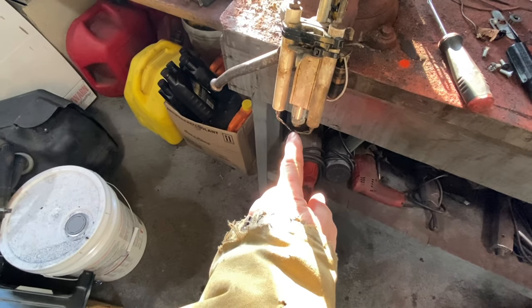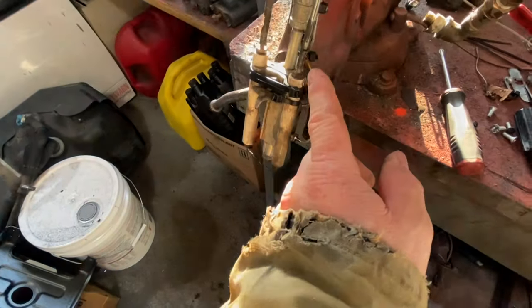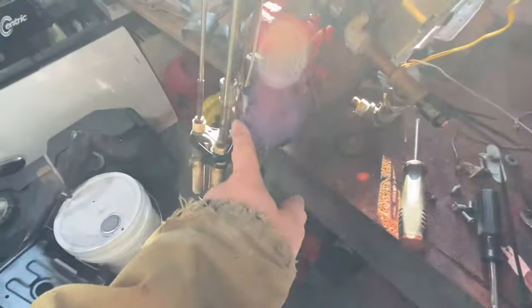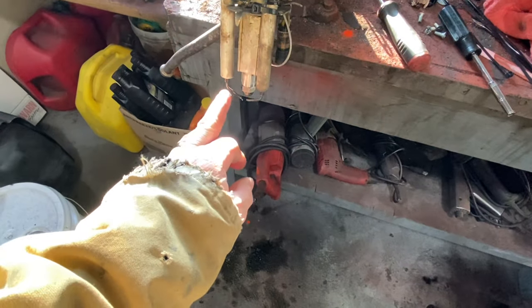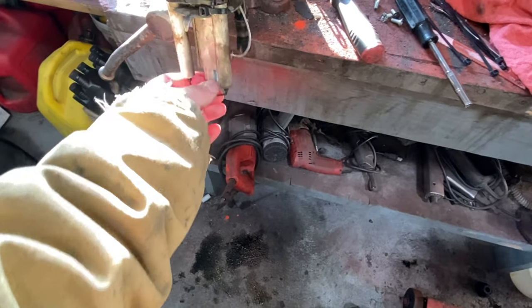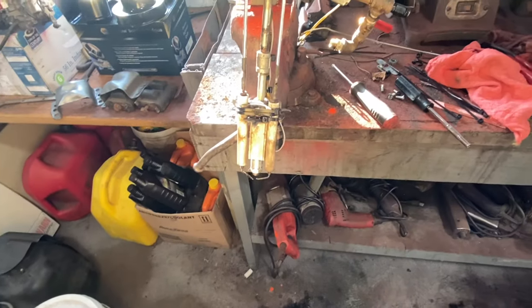You want to make sure you have your air gap correct here and you want the electrodes really nice and solid so they don't move - that's what happened to me, this had broken. I've tied it with zip ties, and you might ask if that's safe or if they'd melt. Actually they don't - these ones have been here for over three years. Yes, this gets hot, but not hot enough to give them any trouble. If you want a more professional look you'd run metal ties, but that makes it harder to service. I had just changed out the thermocoupler before this video and the zip ties made it much easier.